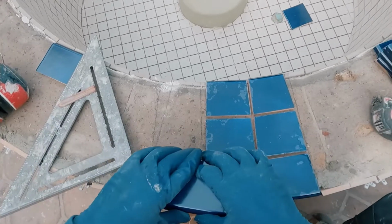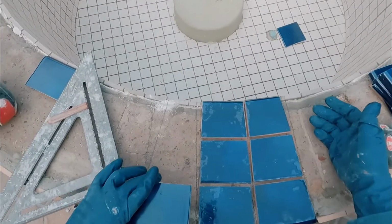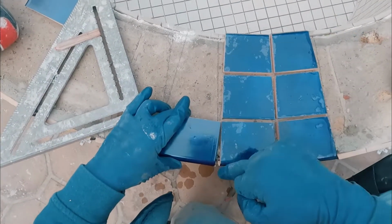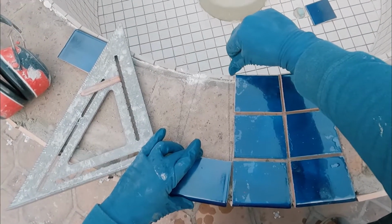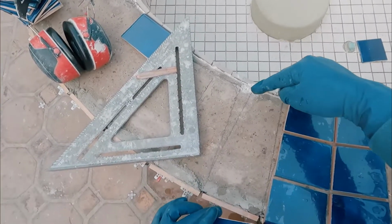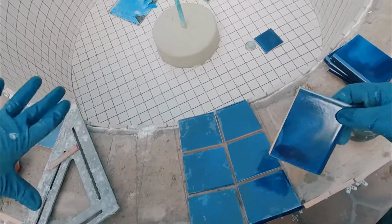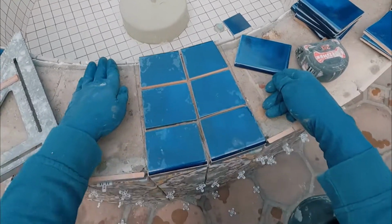It's pretty easy. It's making it more difficult because it's, like I said, 3 tiles. It's pretty wide. But this one here, we're going to do the same. I have my marks. I'm going to draw a mark from this tip here to where the grout joint would end, and I just repeat it all the way around, and it's going to have these nice cuts that just kind of fold out. So if you have any questions about it, let me know in the comments.